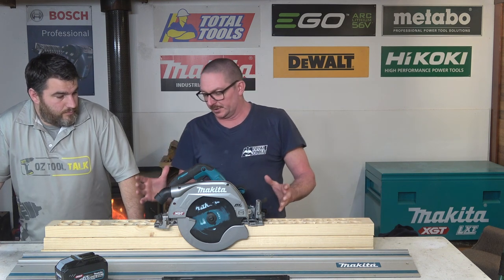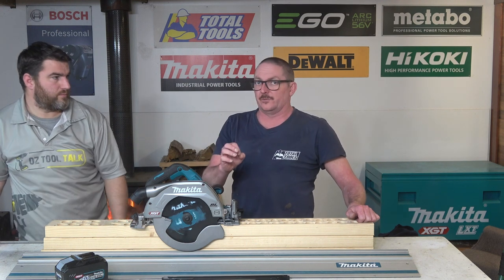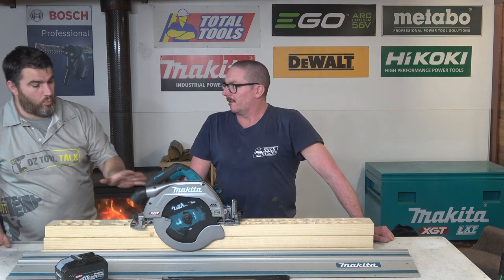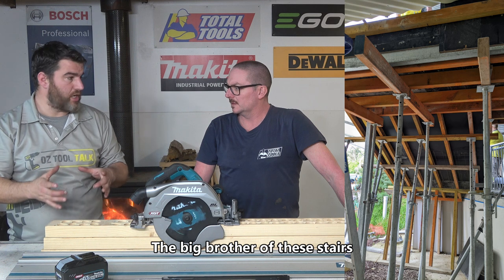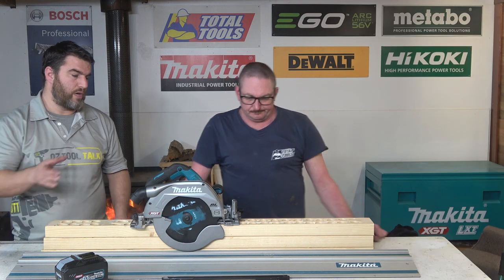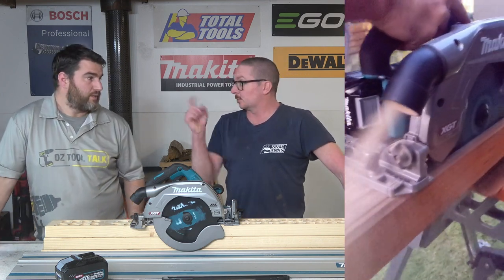I really like Makita's saws in general — I think it's well thought out. It looks big at first but has serious function. Cut capacity is around 85mm depth at 90 degrees — details will be in the description. I really wish I'd had this saw at work about a month ago. We did a big stair build with concrete stairs, three levels, using big chunky LVLs — 80mm by 140 — for supporting formwork up in the air. To have been able to cut them all in one slice rather than turning them over each time would have been really helpful.